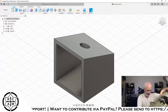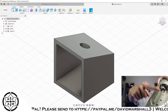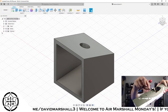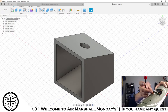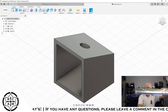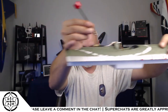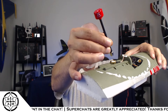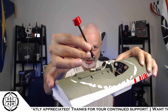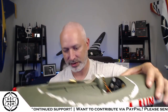now that's the antenna mount, which you see here. That little box is going to go right in this area, and this SMA connector that comes off the back of the VTX is going to go up and through that mount, and then our lollipop antenna is going to sit something like this, where this is the front of the airplane and that's the back. It's going to sit right behind the pilot seat, about right there, and it's going to come up through the top of the canopy, and that's okay. I don't mind that.